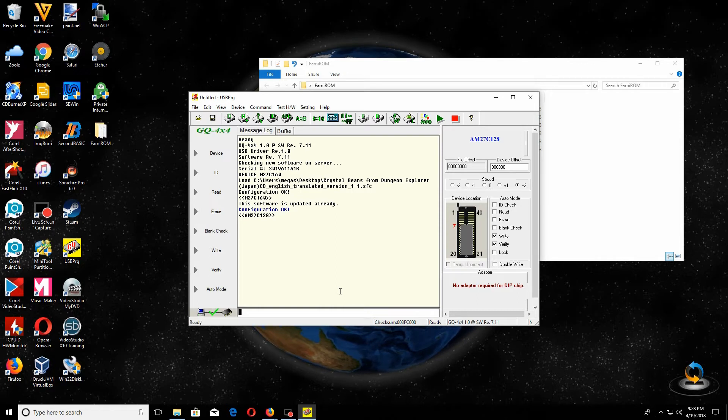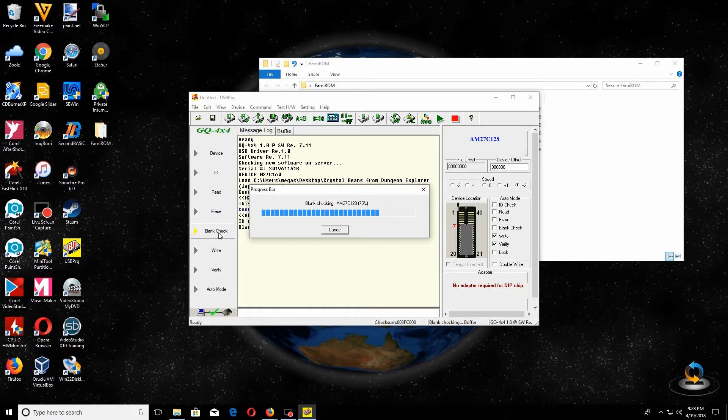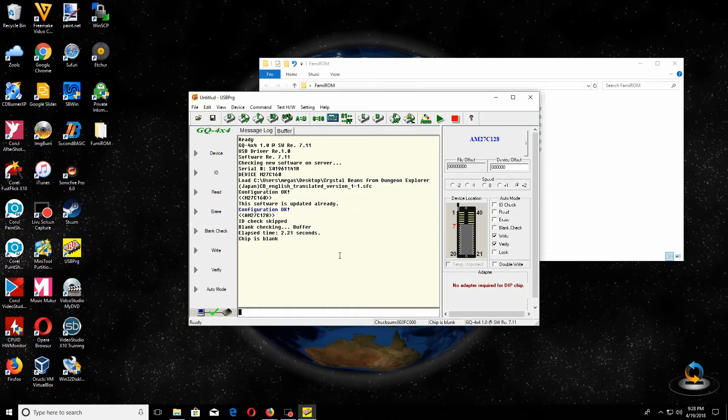I have not tested the chip, so I'm going to do a blank check to make sure the chip is blank and good. Because sometimes, when you buy these — especially from eBay and from China — most of the time they work perfectly, but other times you have to erase them using a UV light, and there are other times when the chip is just bad. Thankfully, the chip is blank — that's perfect. It also shows you the orientation of how to put the chip onto the writer. Remember, the notch — the little circular mark — goes upward. Once you put it in, you have to close the lever to make sure it seals up, otherwise it may not write correctly.